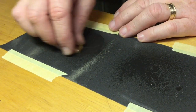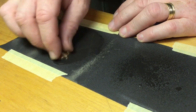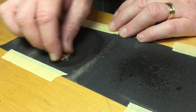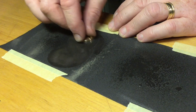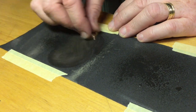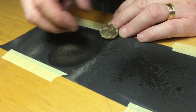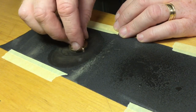I'm sanding the riveted ends of the legs flush with the table's top. By using a figure-eight pattern and regularly doing a quarter turn, it evens out the wear and gives a flatter, truer surface. I also use this method with it the other way up to level out the bottoms of the legs so it sits level on the workbench. Work your way through finer and finer grits, getting rid of all the previous scratches, until it's the finish you want.